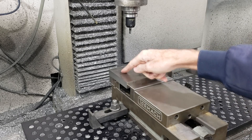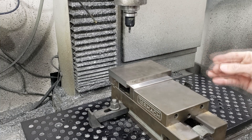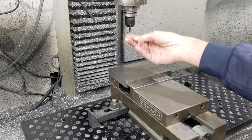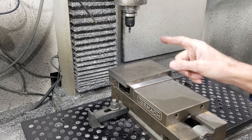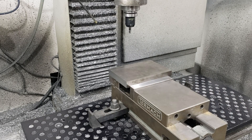The first thing we're going to do is the actual oval shape, which is the actual cutting portion of the die — the lower part of it. We're going to be using my favorite roughing tool for the Tormach 770, which is this Lakeshore Carbide quarter inch four-flute roughing end mill, the Fireplug. This is an awesome rougher for steel.